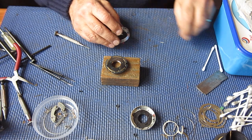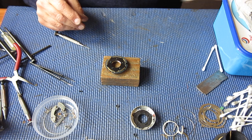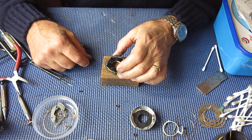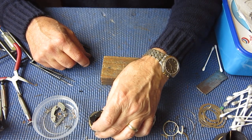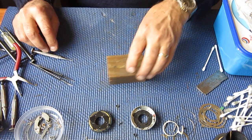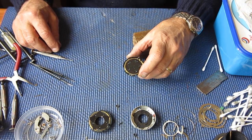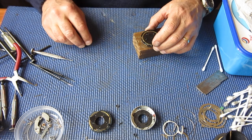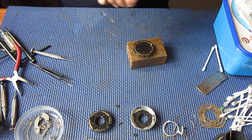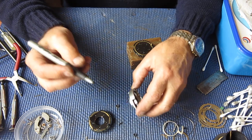That's our shutter case that we started with originally. And this was the shutter case I'd taken from a donor. And the mechanism plate acted in exactly the same fashion. So, now I will clean the mechanism plate from my donor and see how that works with either of those shutter cases. And before I go much further, I think I'll mark my parts so I know which ones are the original